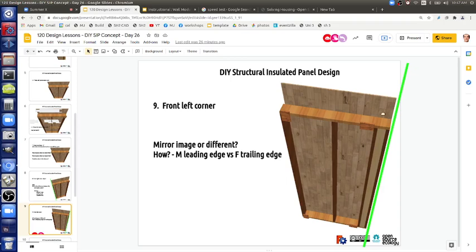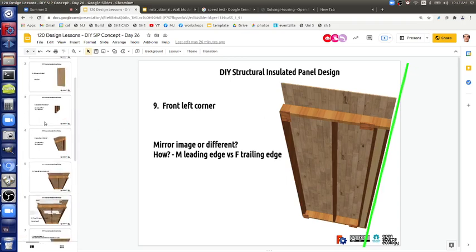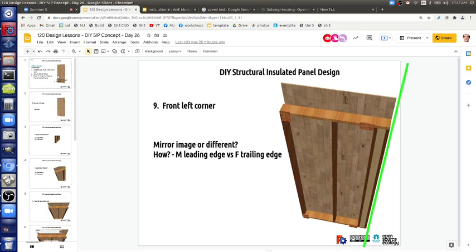It does get a little complicated, but if you get stuck on it, I mean, say you're out there and you actually build this thing and you put the piece of OSB on it, make it look like this in order to make it look like this. Say you have this picture to work from, you'll notice that that's going to be 3.75 there. So you'll know how much you have to cut off that side. It'll probably be 2.25. So that's one way to verify it.